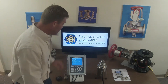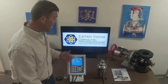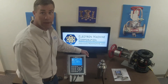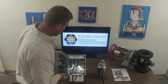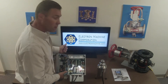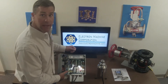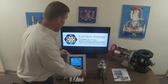All the more sensitive electronics are back here in the console, better protected from heat, vibration, electromagnetic interference, and anything else present in the industrial environment. The measurement is calibrated, temperature compensated, and displayed in any number of units the user might desire. On this door we have all our sensitive digital electronics and microprocessor, easily replaceable via a hinge pin. Customer connections are on the interface board, along with a power supply, output relays for alarms or control, and standard 4-20mA output.